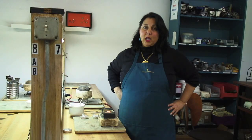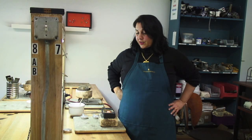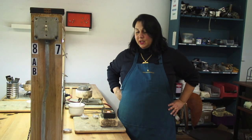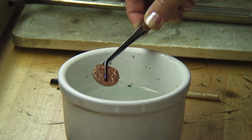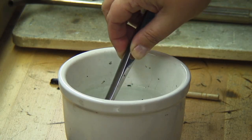As it's cooling, you can either cover it with another charcoal block, or if my metal's been melted a few times, I'll often throw a little borax in there as an extra cleaning agent. This is sort of a brand new ounce, so it's pretty good the way it is, but it never hurts to keep it clean. After you're at least sure that your gold is nice and solid, you can pick it up with your tweezers. Make sure it's not still partially liquid, because who knows what's on your tweezers that you might transfer to your gold. Plunge it in the water. Be very sure when you put it in the water that you hear that last hiss, because if you just plunge it in and pull it right back out, it may not be completely cool and you could really burn your fingers. Make sure to really stir it around in the water for a moment or two before you pull it out.